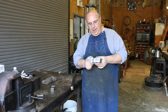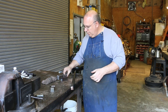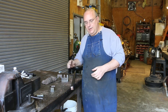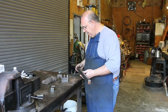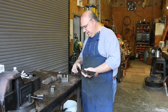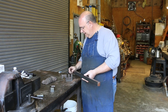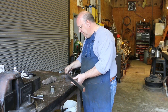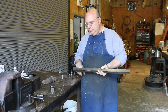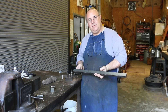The body is pretty much all milled out now, and next I want to work on the actual arms that will come in here and swing down. I've got a piece of cold roll steel here that we're going to make this out of — it's one inch by inch and a quarter rectangular stock. That will just fit right down these little mill slots we put in here. I need to cut two of these three inches long and we'll go do that over on the bandsaw.